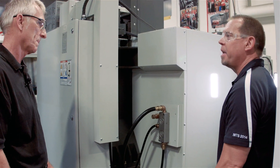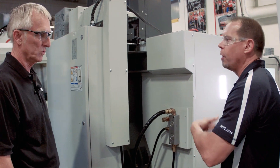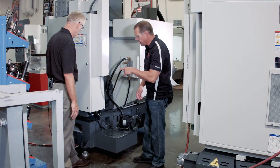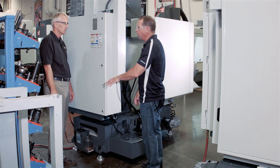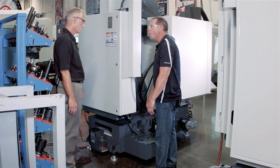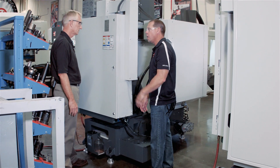We also changed how the coolant flows — how we port the coolant — and that allowed us to get rid of the filter. That's a big deal because now you've got one less person in the shop having to come back and check that filter daily or weekly — one less part. There's one more thing: we've got an oil skimmer now — we didn't used to be able to add this to the Mini Mill. As the coolant breaks down, you get that scum layer and some floaty aluminum chips, and it does a great job at keeping the coolant clean. No shop personnel have to mess with the coolant — this thing just turns on and does the job for you.